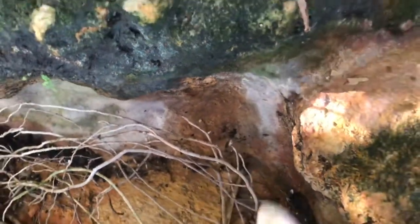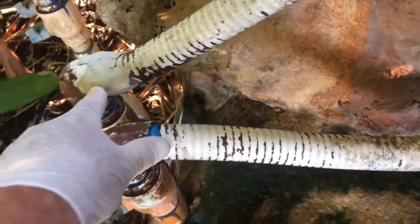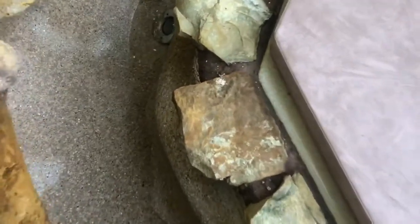Under a quick review that day, we noticed that right here behind the rocks there was leaking — all through back in here inside the rock formation. Also, on one of the valves they had put putty around it. I asked the client to go ahead and drain out some of the water, which he did for us.